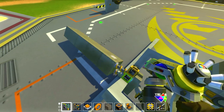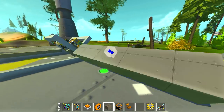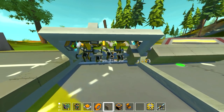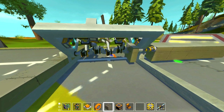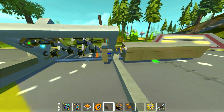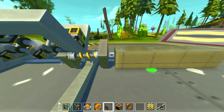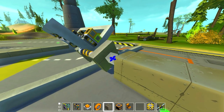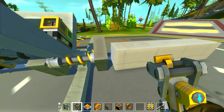Now, it's got a ton of power, but of course the problem being it needs this massive flywheel. Like, massive, because it has to have enough momentum to carry the weight of this entire axle through the point where the pistons aren't moving at all. And so if we reduce this flywheel, you'll just chop it off there. You can see they won't actually rotate fully. It'll just go back and forth and back and forth. And, you know, it makes it kind of useless.